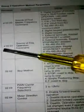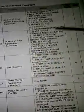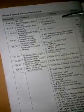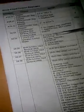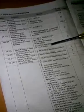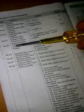After setting parameter 2.01 to the external terminal, we need to set one more parameter so that we can use the master multi-function input to stop, start, forward, and reverse the motor. There are three techniques to use the external terminal to make the forward, reverse, stop, and start — two-wire and three-wire operation.